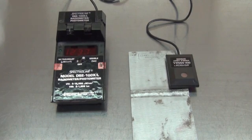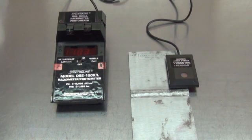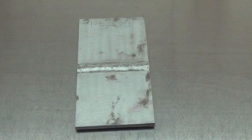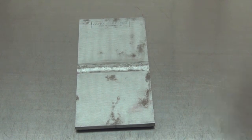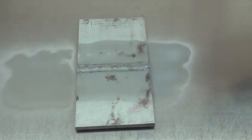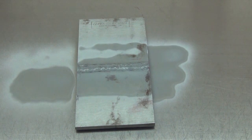We check the light level and make sure it's at least 1000 lux — right now it's approximately 1200 lux. We are ready to spray the developer. You will start seeing the indications as they show up on the surface in red color.